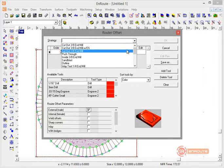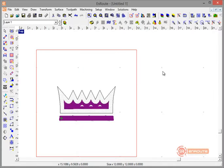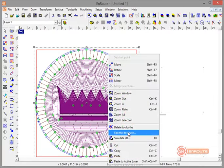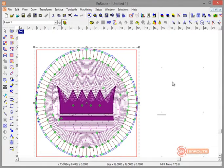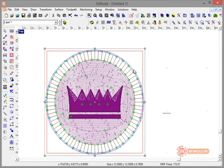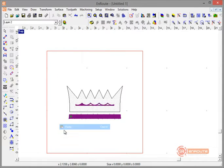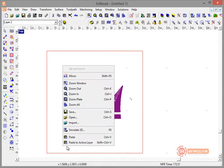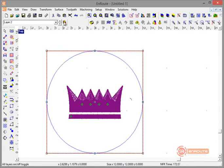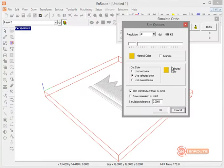The last toolpath is the cutout. I'll use a quarter inch end mill already in use, apply the cutout toolpath at 0.76 inches — just slightly through the material. Now I'll copy this geometry with Control+C, paste it to the active layer, delete that toolpath, and turn on all layers while keeping the geometry selected so I can use it as a selected contour mask in the simulation.